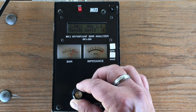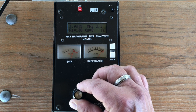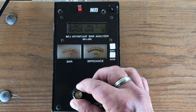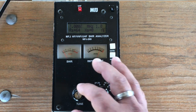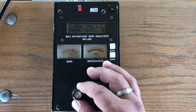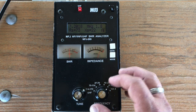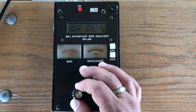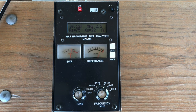So now we're in the 75 meters-ish area. Ohms are a little high, we're at 3.0 — I'm sure how I have this antenna configured is affecting that. The ends are very low to the ground, but not bad. It would still work. So let's go to 40 now. Right at the bottom we're 1.0, 60-ish ohms. Now we're in the phone portion and out of band. So let's check 30 meters. There's the bottom and that's all we get. So that looks okay.